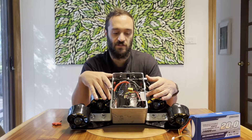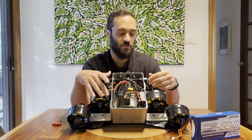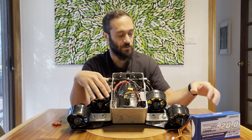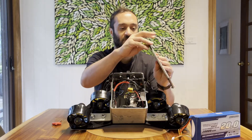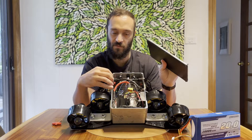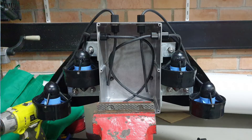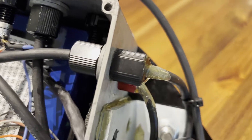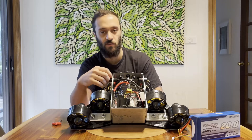A big challenge of this design is making everything waterproof and submersion proof. I just used what I had available to keep the cost low. This aluminium box isn't waterproof on its own, but I did put a rubber sheet as an interface between the lid and the bulk of the box. I've also used penetrators from Blue Robotics to bring the cables into the box. These have a small o-ring interfacing on the surface and they're also filled with epoxy to make the actual cable passing through the bore watertight.